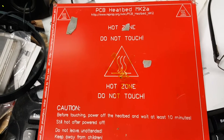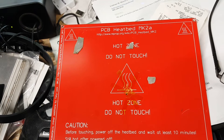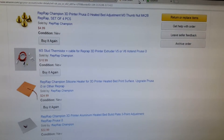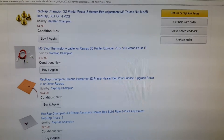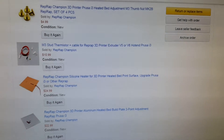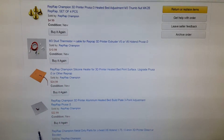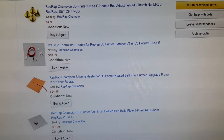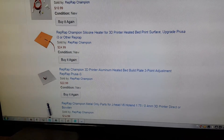That's an original Prusa MK2, but they work. They pull roughly about 100–120 watts. The old RAMPS 1.4 controllers are rated for 11 amps at the plug. You usually, at some point, end up melting one of those plugs. I've done it. I know a lot of other people that have done it. Even on the new controllers, I've seen it happen. And the bed is really slow to heat up. So I finally decided I was going with a silicone-style bed for it.